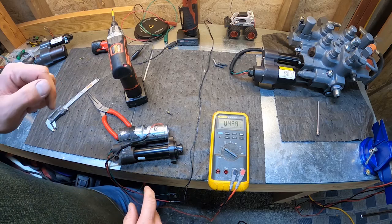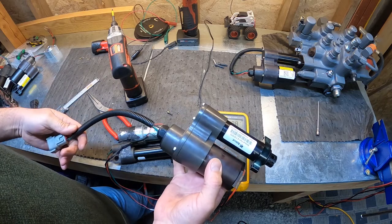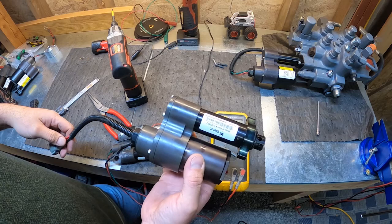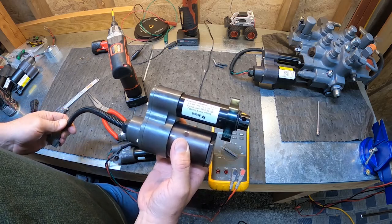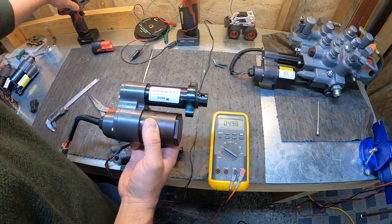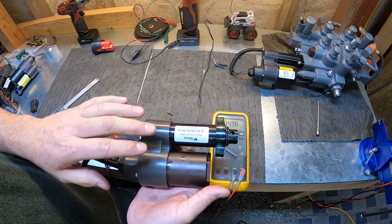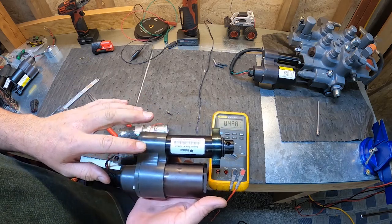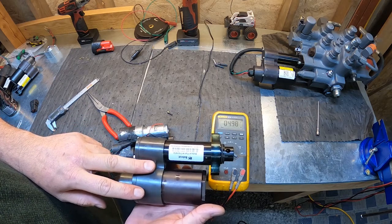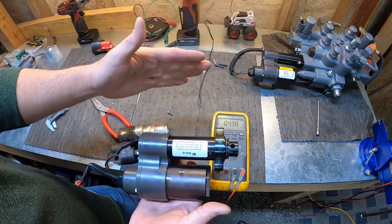Let's move to the second generation, which was this style here. They call this the flip actuator. What does flip stand for? Faster, longer life, improved performance. And that's flip. Bobcat, to this present day, 2020, only offers 2 part numbers for actuators. You have the new style, which is the flip, the faster ones. And then you've got this style, but it's slower.